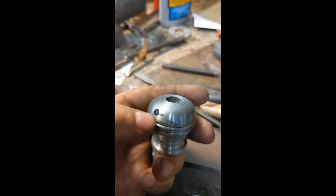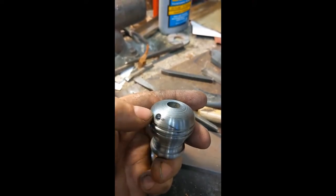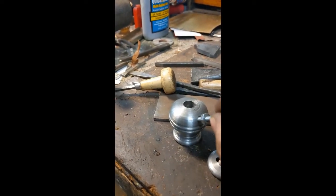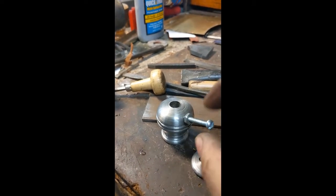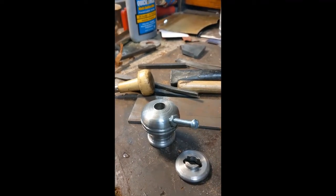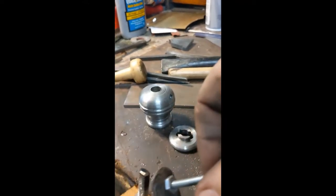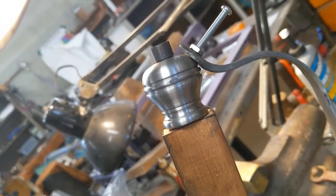You can see I've also given this a shallow counter bore. That's so that I don't have to try to grab the thread across an angle - it makes it much easier to assemble. Without that I was having a lot of trouble putting this in. So what I did is I put it back in the drill press, same setup, and just counter bored it the pass-through size.